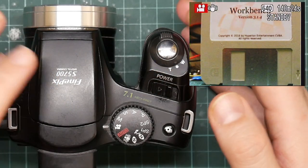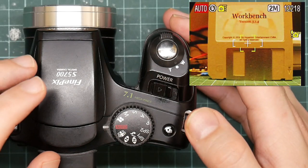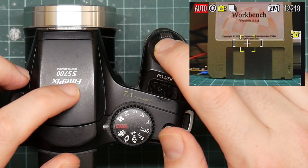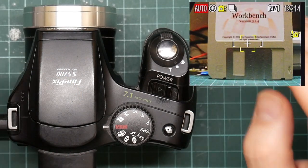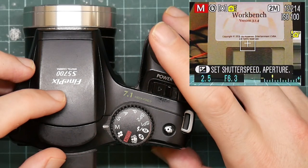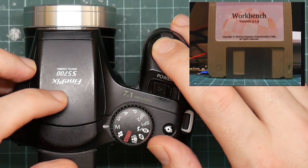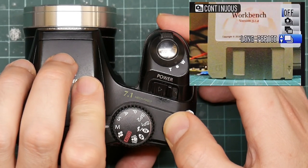So I'm actually going to resort to using time-lapse. Luckily if I put this back to auto there is a feature called continuous recording where if I push this button and go down to long period, and if I hold down the trigger it takes continuous pictures. I can decrease the period a bit by switching it to manual mode, which I want to use anyway, and increasing the shutter delay. So yeah, that's actually set to 2.5 — or 1/2.5 of a second — so that it's not doing continuous recording because every time you change mode it resets.